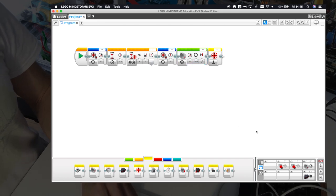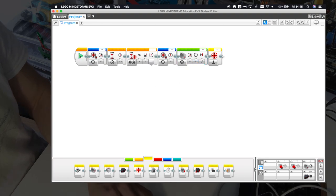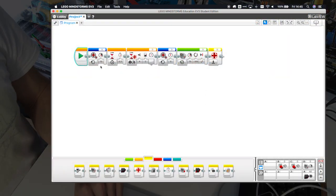Let's run the program so you can see how the legs move to one extreme and then the lizard stops — so this is one extreme. Then we will run the motor in reverse until we are back in the middle and reset the position there. Setting the power to 70, I think it's about minus 200 degrees to run it back to the middle. Now it's more or less parallel. So in this program we turn on the voltage, wait until the motor gets up to speed, wait until the speed drops because it's reaching a limit, turn off the voltage, then turn back to center.